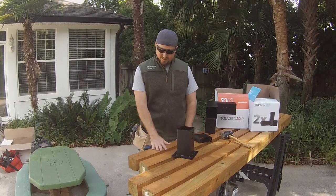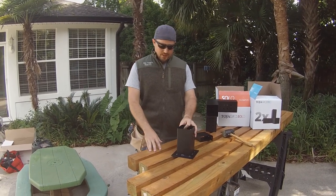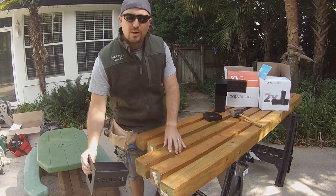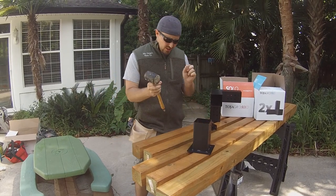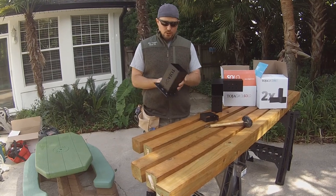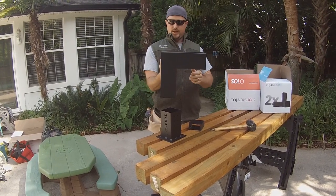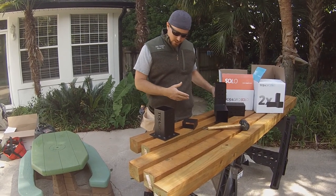We finished staining all the wood and let it sit outside for about two weeks. When we got this wood it was very saturated with the pressure treating, so it's dried up quite a bit. The Toja Grid components should slide on relatively easily — for some pieces they do, but others still aren't quite dry enough and only go on about halfway. We're going to go against the recommendations and tap them on with a mallet since they're really, really close. But if you want to do it right, let the wood dry totally. This particular kit from Toja Grid has about three components: a base or wall mount, a two-by-four rafter mount, and a heavy-duty mount for the front, side, and corner. This is really heavy-duty, good quality. I'm not a sponsor of Toja Grid, but it seems like a pretty neat kit.